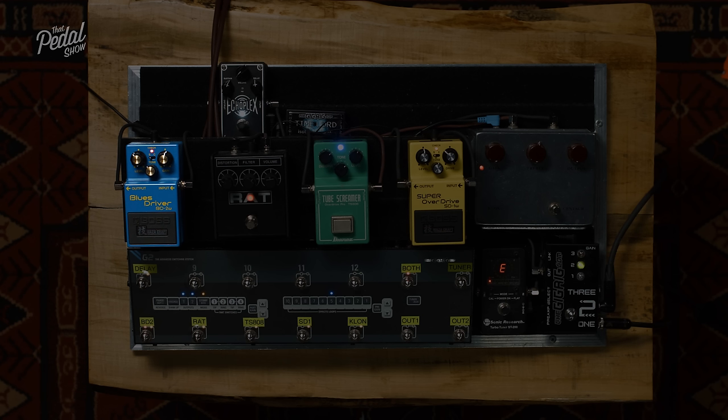Most of the stuff we've seen today is that. But for example, if you've got what they call a Dumble-esque overdrive, what they might do is take a mid-frequency thing, put it before the gain, and leave the bass and treble after the gain. So what you'll see is how creative these designers are when they're coming up with this stuff. It's mind-blowing. The more you look into it, there are some really clever people out there. And basically, how you mix all that stuff together and how you achieve it is what gives you the character of the overdrive pedal in the end. Absolutely.